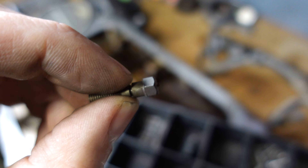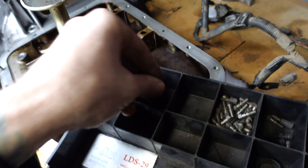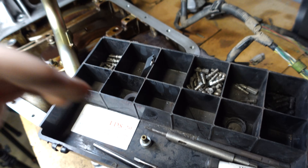The top part of this pin, the part above my fingers, is going to snap off once we tighten it into the block. Essentially you're going to use something like this spacing tool, work your way up the crack, and completely get the crack filled from the bottom to the top.